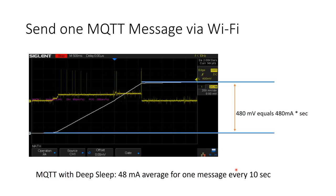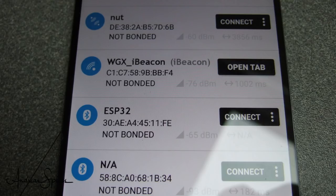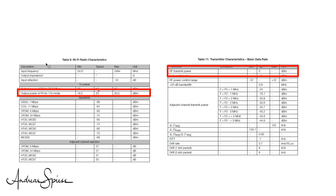Now we're curious how this compares to Bluetooth Low Energy. I use a sketch from Anthony Elder to build a simple BLE beacon named ESP32 — and here we see it on our smartphone in NRF Connect. The first thing we notice is that it took about 800 milliseconds to send the message. Secondly, we see no current spikes, even though the transmitter sent data. Why? The output power in Wi-Fi mode is much higher than in Bluetooth: 0 dBm is 1mW, 20 dBm is 100mW. So the reach of Bluetooth should also be smaller — but this is stuff for another video.